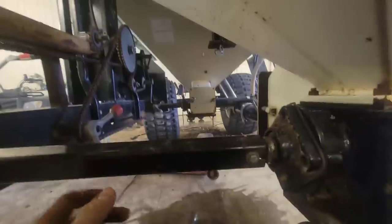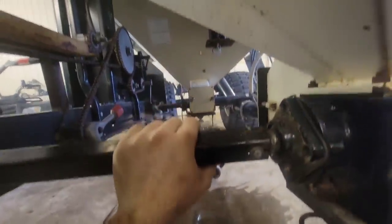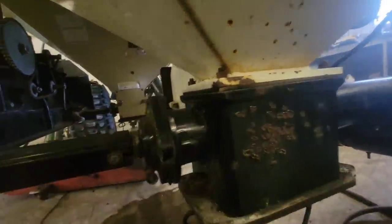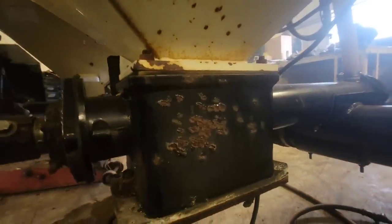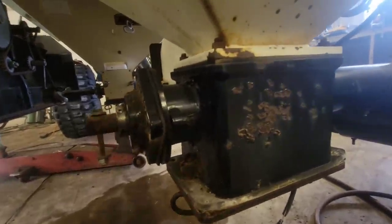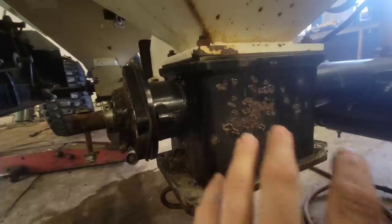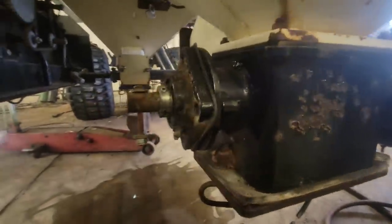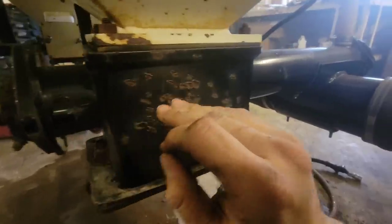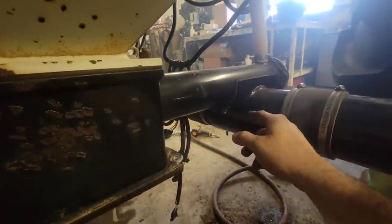It's the next day here. Dad's got the hitch all welded back together up there, that's why I'm underneath it now — it's not going to fall on me. I started working on taking this metering auger out because I bought a fancy triple-flighting auger. With more flighting, when you're doing a real small rate like canola or millet, the more flightings you have the more even the feeding will be, dumping your product into the airstream to go to the drill.